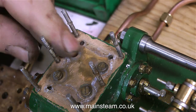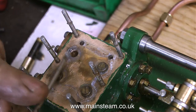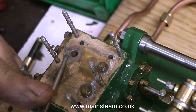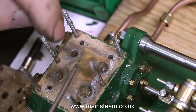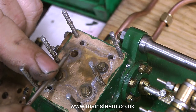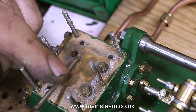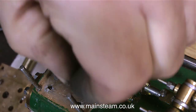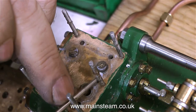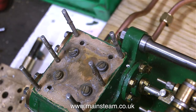So by now you get the gist of what I'm doing. I remove the valve and clean away all the silicone rubber from around the valve. And what I'm going to do is relap the valve slightly just using some T-Cut — nothing too abrasive. T-Cut is not a very harsh abrasive; it's what they use on motor vehicles for cutting back the paint, so it's ideal for just cleaning up the valve seats. You don't need to use commercial grinding paste — that is a little bit too aggressive. It's the same sequence on all of the valves: remove the valve, remove the silicone rubber from the valve, remove the silicone rubber from around the valve, clean up everywhere around the valve, and then relap the valve in with some T-Cut.